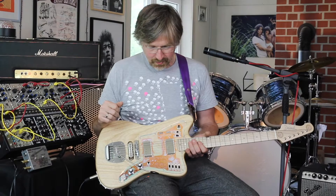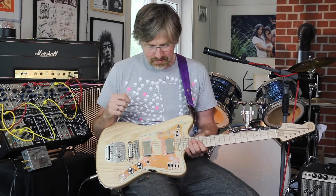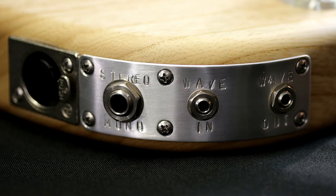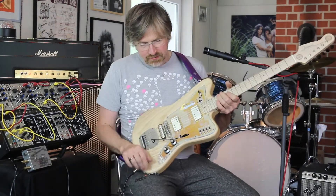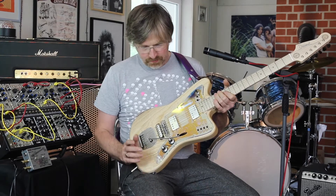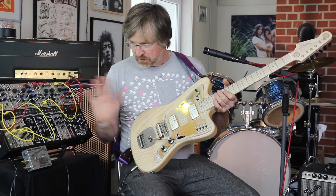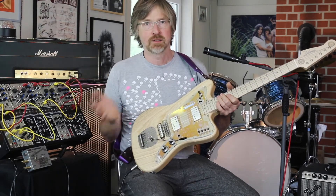We have a way to get to the LFO of the Leslie circuit, and we are putting it out via a five-pole XLR cable, or alternatively directly as a wave-in/wave-out jack. We have a regular mono/stereo jack for regular guitar use. The main part is that we have a waveform selector switch, so you can control the waveform being sent out in sync with a modular or any other device that understands CV or waveform voltages.